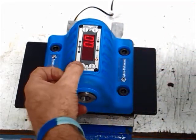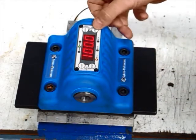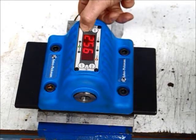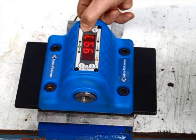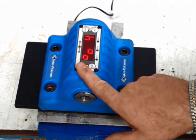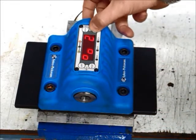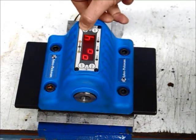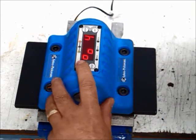Our scale is set by using the limit button. You can see that 100 is set, but if we want to change it we can come down or up — that will be 100 units to the range we select. So back to 100. Press the limit button to store, and then we have the choice of how accurate we want our tester to respond. We set 4% as that's the tolerance for checking wrenches.